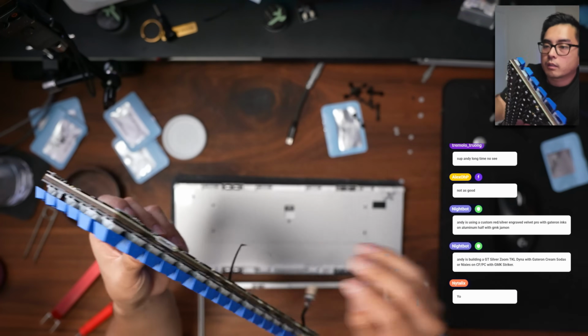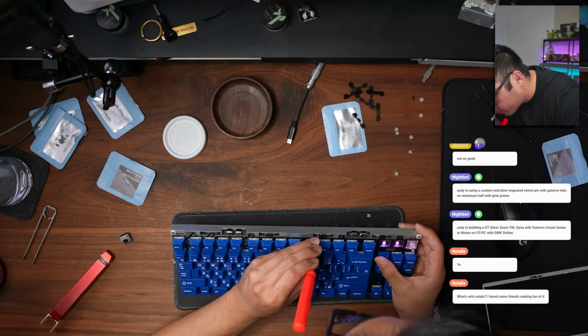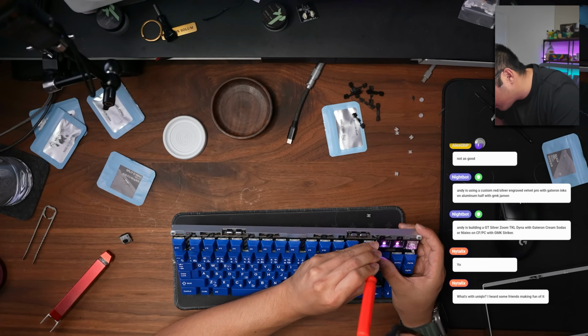I really tried not to do the split O-ring because it's so finicky, because you have to have two little screws and screw all over the case so that it has a thing for the O-ring to mount to. The split O-ring is a PCB mount, and honestly, after I put it all together, put in all the effort, the split O-ring sounded the best.